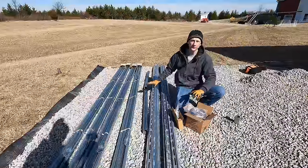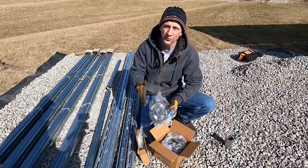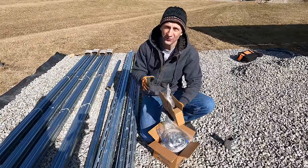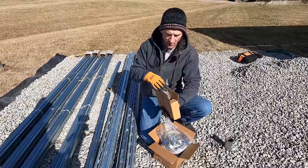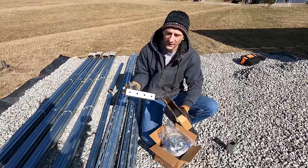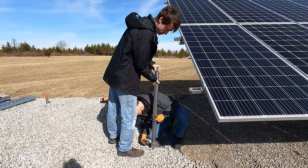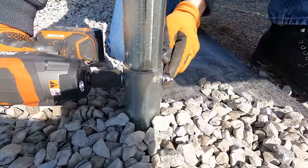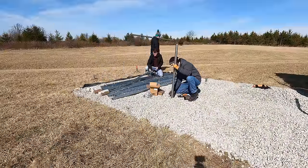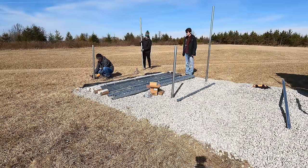We have all the materials for racking setting out here ready to put together. All of the hardware for each one of the sets is in one bag, so it's really organized and easy to put together. The connectors for the east-west purlins all come in a box with the bolting hardware and connecting brackets. Let's get started putting up the vertical poles. As long as you faced all of the bolt holes in your screw assemblies east-west, the poles are very easy to assemble with just one bolt through the bottom hole. Short poles go on the south side and long poles on the north side.